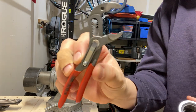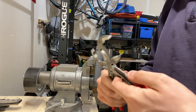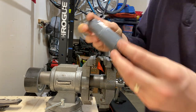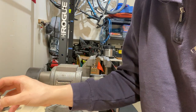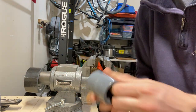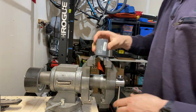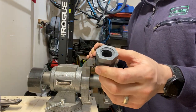So you can see how tight I got it with the 125, and you saw me using these guys in opposite directions. Let's look at how I marred these up — you can see how marred up that is. If you're a real professional making sure it looks good you can obviously do better than this, but if you're just going then it will tend to get all marred up. So you decide whether or not you care. This is a one inch to half inch bushing.